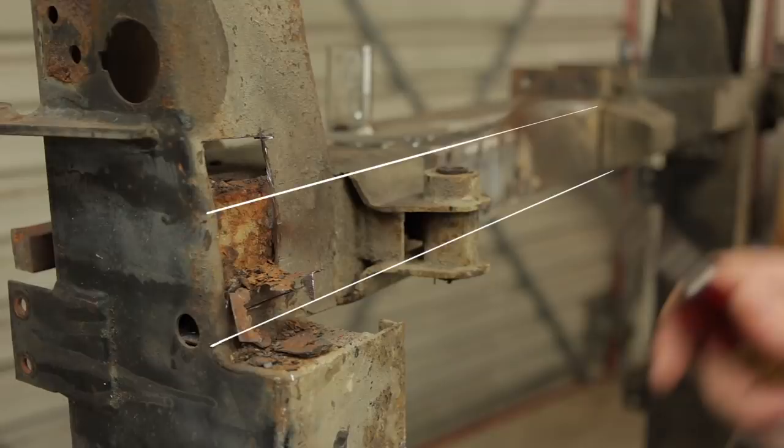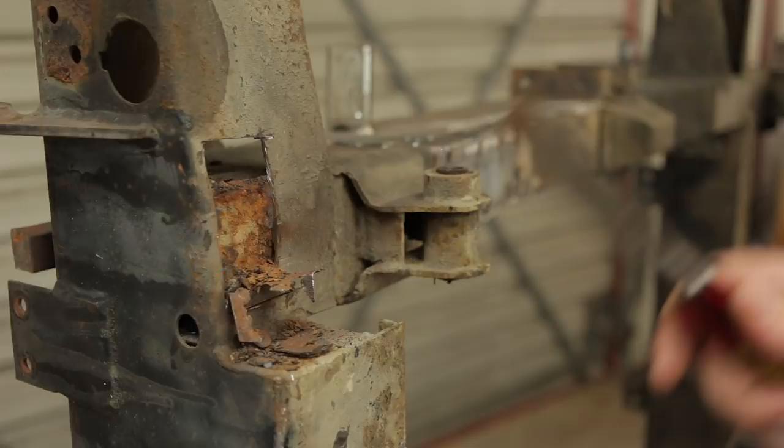This is the underside of the chassis rail. The crossmember sort of slides over the end of the rails, so there's an overlap. The way this is constructed, the chassis rail ends about here, so any water inside the chassis is of course going to run between these two pieces. Also, you can see the vertical face of the chassis rail in here. So the hole's a little off. I'm only really pointing this out so we can laugh at the guy who almost missed a 3-inch wide target.